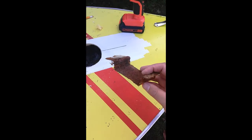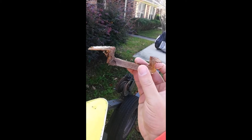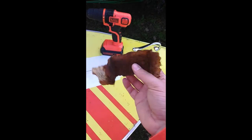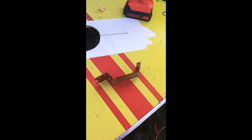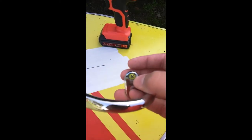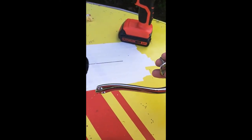Upon feeling around more closely, that bracket piece affixed to the bottom hole was actually loose on the right-hand side, so I managed to pry it off completely. It obviously won't hold the piece in place, but again I have the inspection port so I can make an adjustment if needed. Now it feels smooth enough that I should be able to fit another piece in there. I pried the other side off as well. After assessing the situation, it looks like I need a piece of 1x3 or 1x4 wood, cut to length, as a backer block. I'll pick up some number 8 stainless steel screws — either machine screws or wood screws, though I've read wood screws may be better.